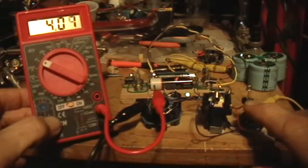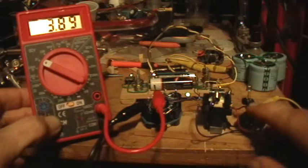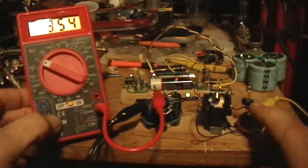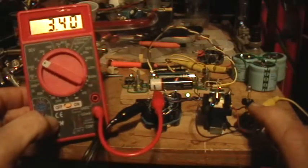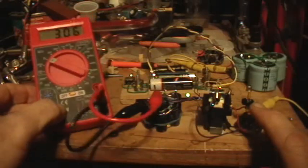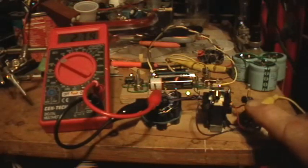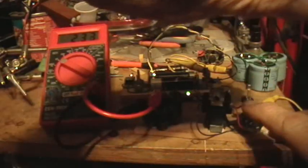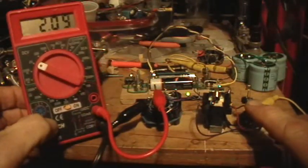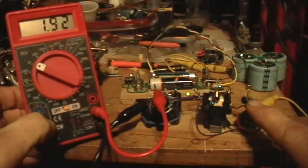The light stays at a low and constant voltage — you may have noticed the light was almost as bright at the full 12-volt charge as it was with only the 2-volt charge. That's because there's some kind of internal natural voltage regulation happening; the Joule Thief effect is regulated somehow by this circuit. So even with 12 volts on the capacitor you just get a nice little dim ghost light. It's still going — off, on, off, on. We were already down to about 10 volts when I started and now it's going down further.